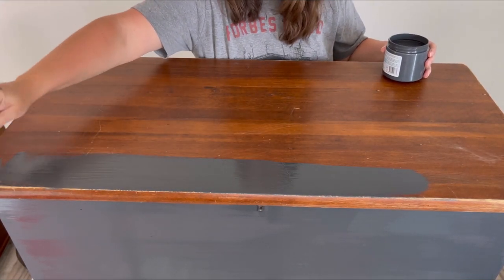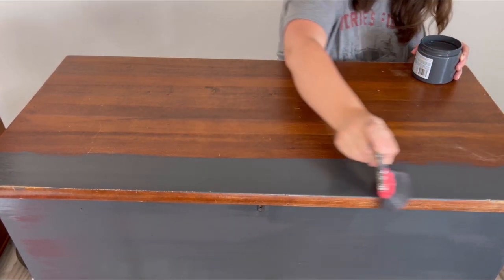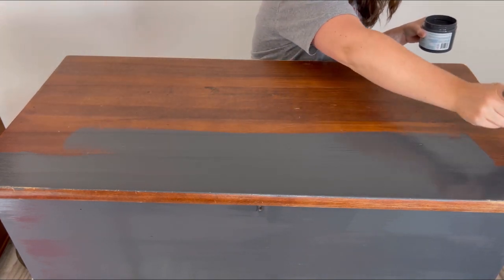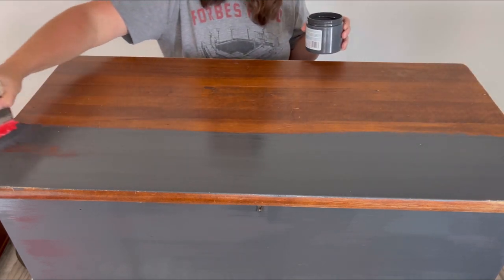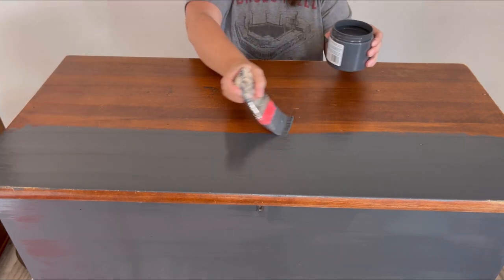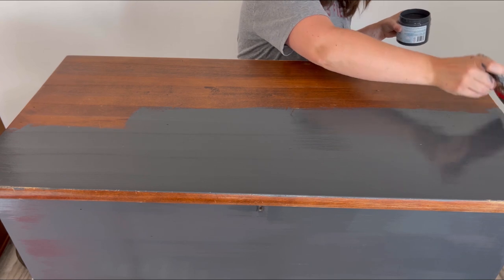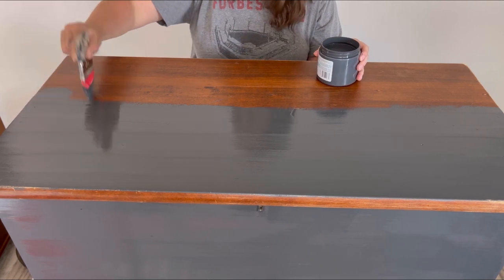Following these few guidelines, I have just fallen in love with silk. I love the silky smooth finish — it has like a semi-satin finish and it's just gorgeous. It's so buttery and nice. It has the sealer, the top coat, and the paint all in one. It's just really easy to use. If you're doing one color, I highly recommend silk. If you're going to do some blending or shading, then I would go back to chalk paint, because you want to use your water mister for blending and you can't do that with silk.